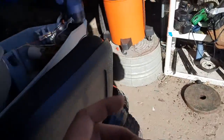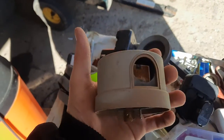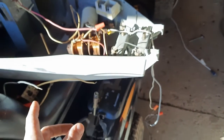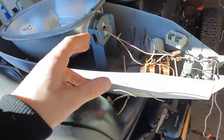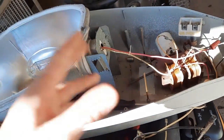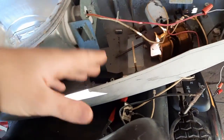Now, the mercury vapor lamp did not have a lamp starter in it, but it had a photocell or daylight sensor that was mounted on top of the fixture. This is the said device. And this fixture here did not have a daylight sensor. This would have been a fixture that had two wires run into it and was turned on and off via a lamp timer in some building somewhere or on a pole, or maybe even another photocell with a contactor.